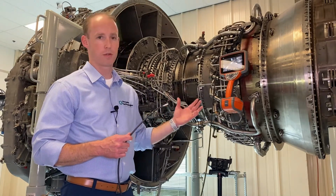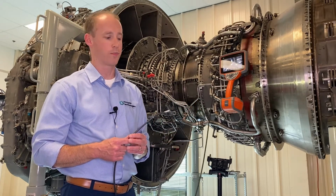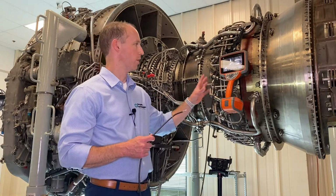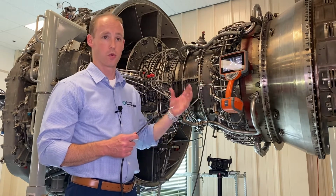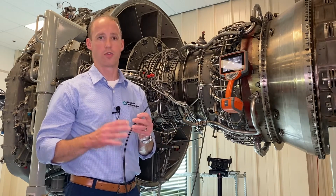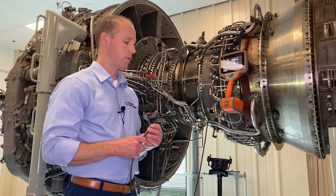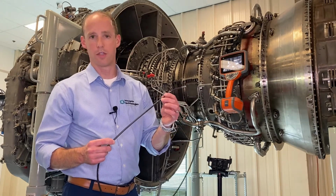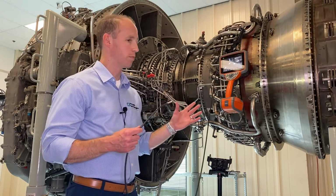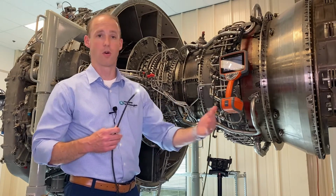And so with the Everest Mentor Flex, we've made significant improvements to all 3 of these characteristics. The way we've done this is through 2 major design changes. We've built the product with new servo motors. That's what actually controls the articulation. Those servo motors are more powerful and they're quieter. So they have 2.5 times the torque as any motor we've used in the past. Number 2, we've redesigned the interior of the insertion tube to reduce friction on the steering cables by 16%. So these 2 improvements, you're going to have vast improvements in responsiveness, articulation range, and it's going to hold up over the life of the product.